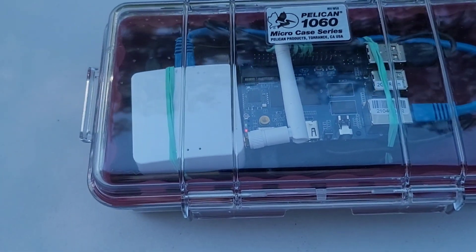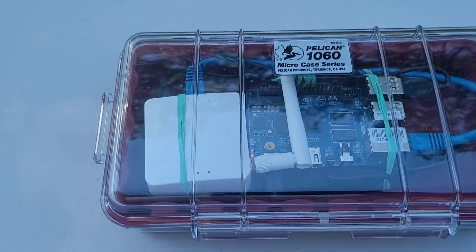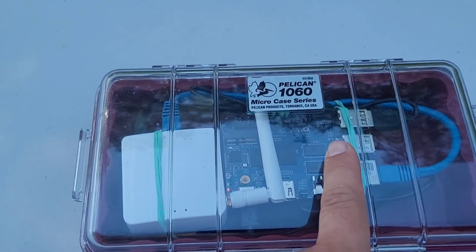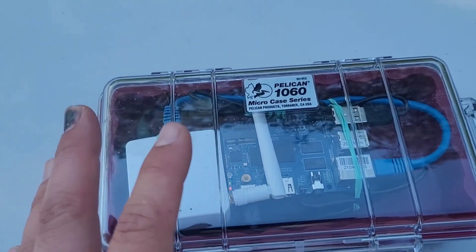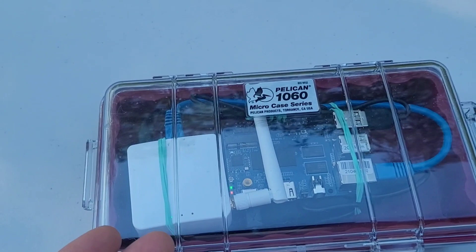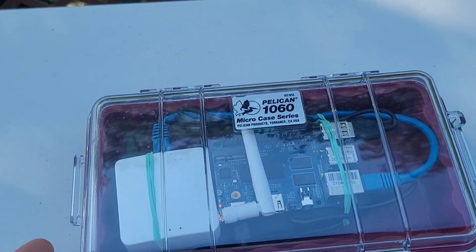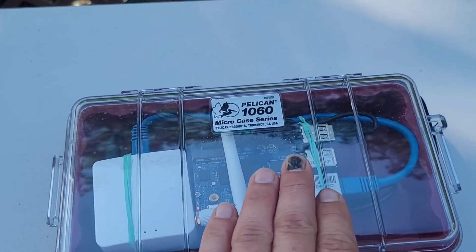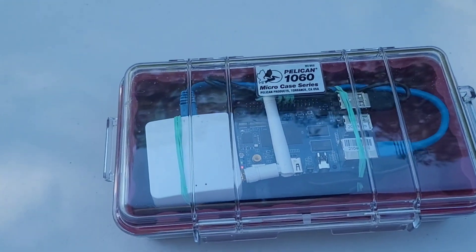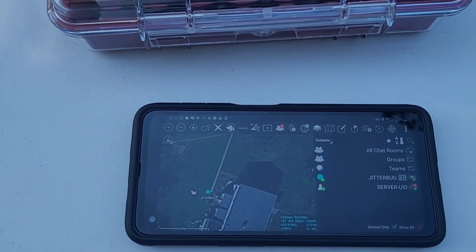The TAC-in-the-box is connecting to my existing wireless network at my office and piggybacks that connection over to the Banana Pi. From there it uses the VPN to connect. So as long as this is connected to the internet in any way — whether you have a USB 4G modem, an Ethernet uplink, or a wireless uplink — as long as it has internet connectivity, you'll be able to see it on the ZeroTier network, as long as the Android phone is also connected to ZeroTier.